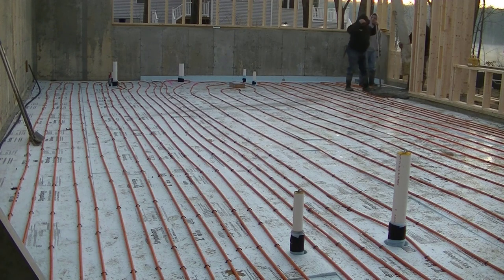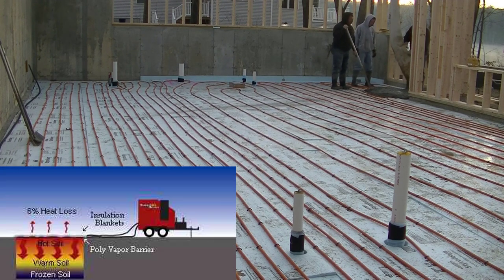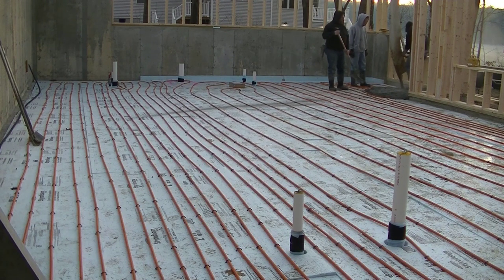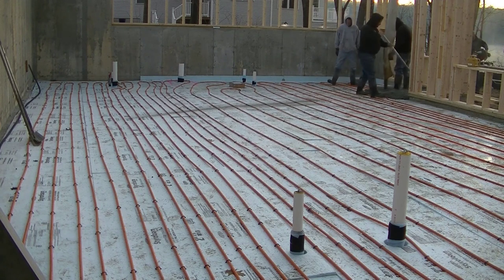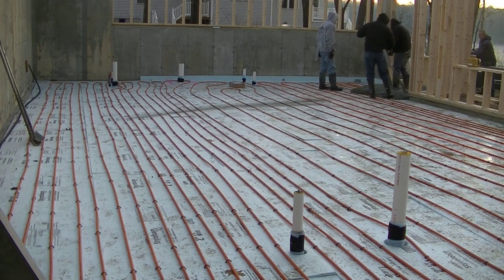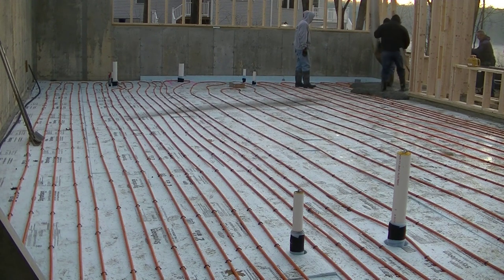The mix design we're going to use is going to really help set this stuff up. Now if it was really cold, you could use a ground heater like this and hook it right up to the radiant tubing in the floor, then turn it on low — 60, 70 degrees — and that would help keep the slab warm. We've had to do that quite a few times when temps were in the 20s, but today it's 32 starting out and it's going to get up to about 40, 41 degrees.